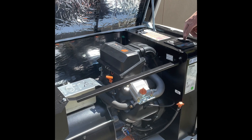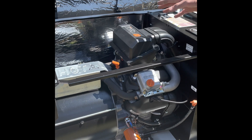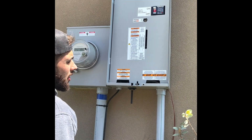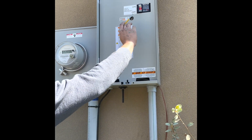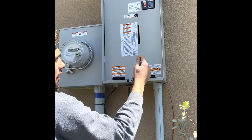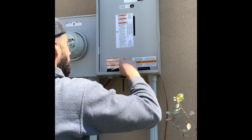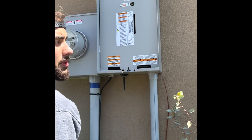If it turns on by itself, it won't mess up the utility power — it just does it to get things going. We're going to hit the utility power to show you the automatic transfer. Yellow lever up means on utility power. When utility power goes off, after about 10 seconds it comes down with a loud bang. If it doesn't automatically do that, use this yellow stick — put it in and yank it down — and it'll manually turn the generator on.